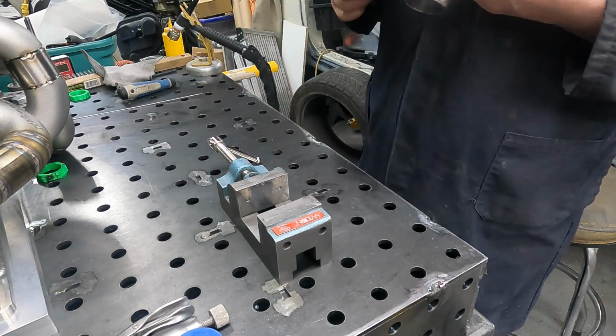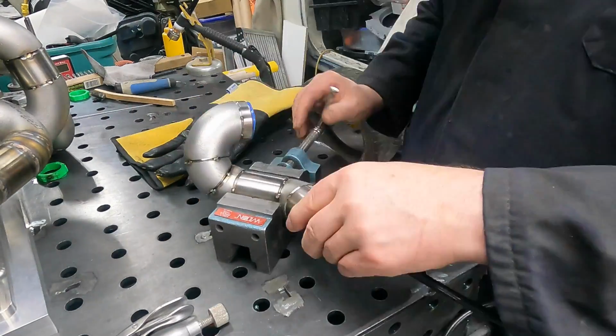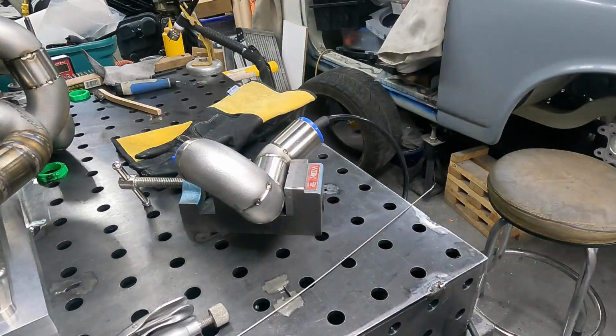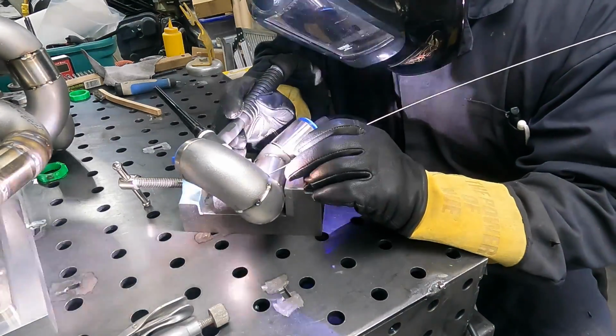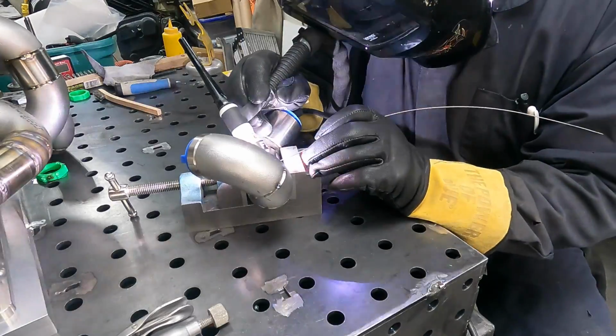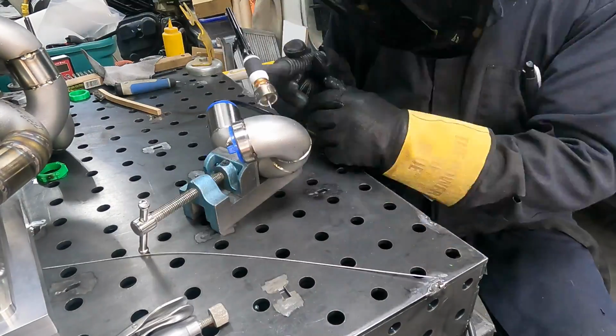Anyway, that was getting a little bit frustrating for me, so I stopped. Again, the importance of taking the day off and just walking away from it. And then I figured out, you know what? Half of it was my weld process, that I was actually starting my welds almost randomly along the tube, or the pipe.